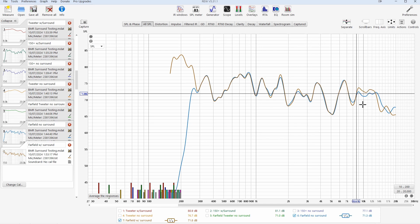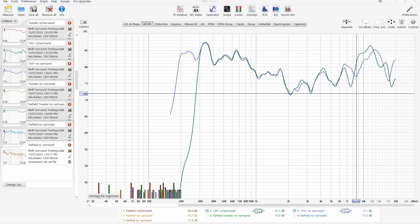So I still think I'd like to extend this all the way out to 20 kHz if I can. What's on the agenda now is to play around with the waveguide shape and see if I can push the response further into the high frequency rather than just boosting down here. Maybe the best solution is literally no surround, or maybe it's a different high-frequency driver altogether. I said in the last video I'm open to trying multiple drivers to get that right — this is just the first one. So I'll see what I can do, then move on knowing whether this is a yes or a no. Thanks for tuning in, and if you're enjoying these videos please subscribe and catch the next one. See you next time.